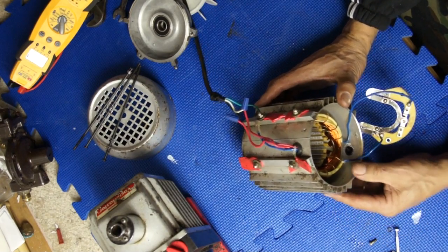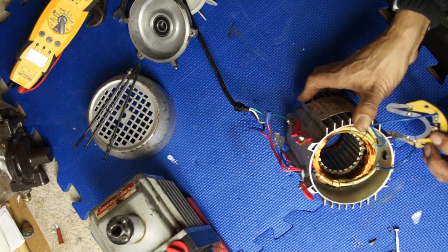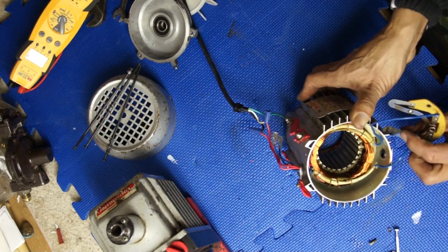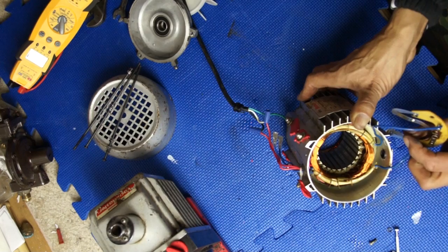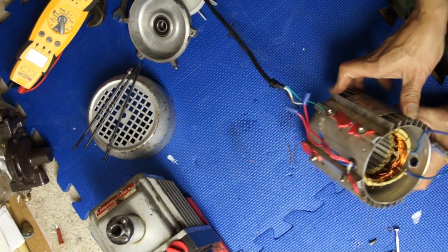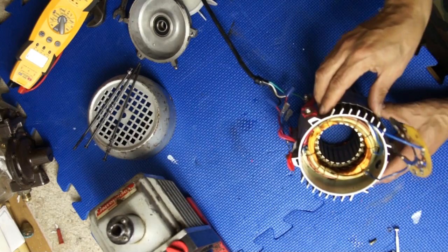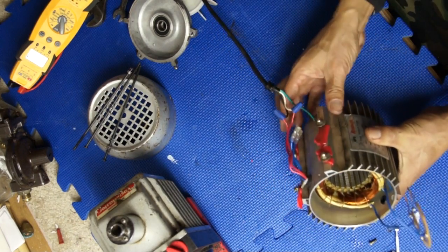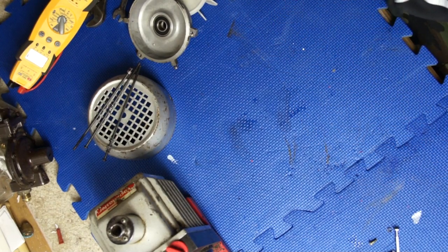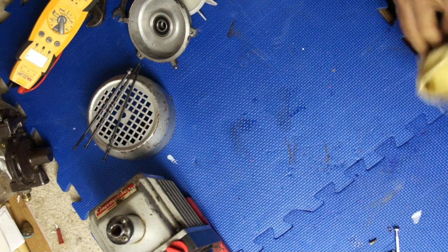Basically I don't see any damage to the winding on this model. The contacts are working — shut off is working. The winding looks fine with no leak. This part of the motor end is nice and dry — it's fine. I don't see any signs of burning either.